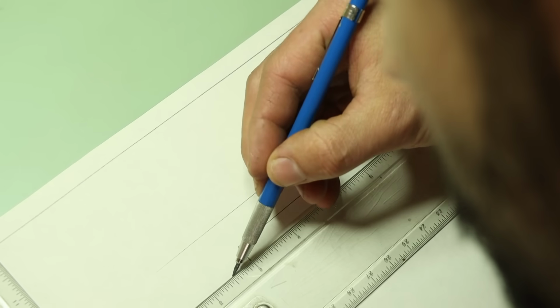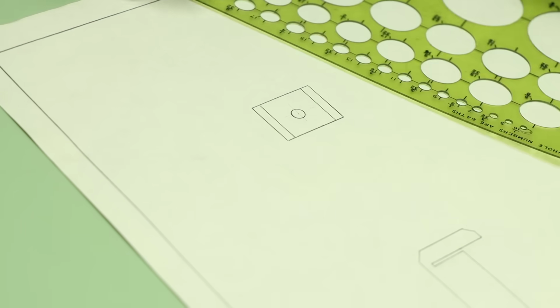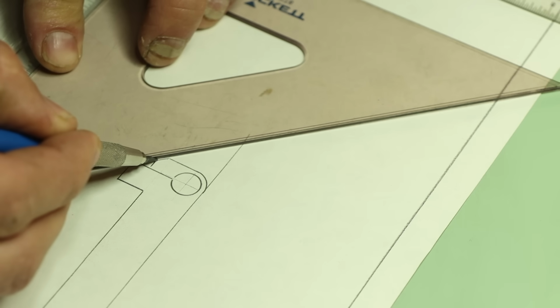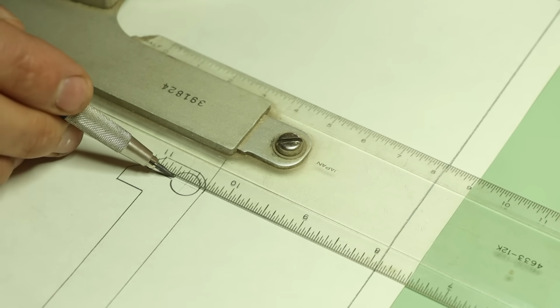This also makes it adjustable, which is nice since the stroke of the compound is a lot larger than that of the dial indicator. The clamping mechanism is formed by a slit with a cross hole through it for a simple thumb screw. The indicator will mount on the opposite end through a bore that accepts the 3/8 stem, and it's clamped in place with a similar slit and screw mechanism.